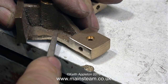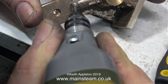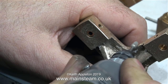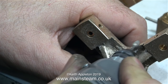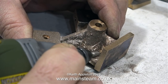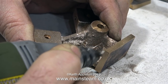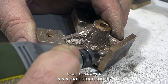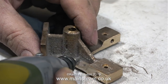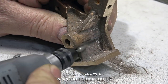So it's time to call in the cavalry in the way of my Proxxon motor tool with a diamond burr. Doing it this way is really good — much faster, much more efficient — and it's making a great job of tidying up the casting. You have to be very careful though: one slip in the wrong place with this diamond burr and parts of the casting could be ruined. The other disadvantage is it's making a bit of dust, so once again, apart from eye protection, a breathing mask is the order of the day. I'll speed up the footage so I get through the job a little bit quicker.